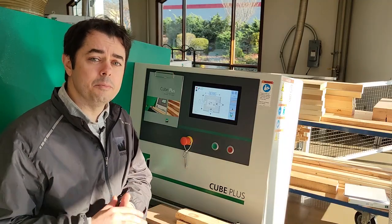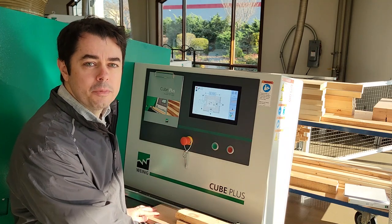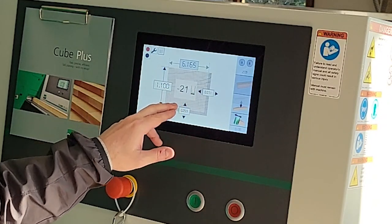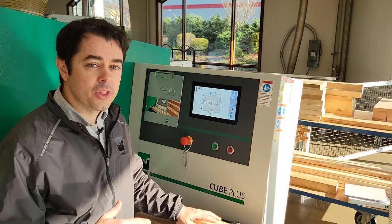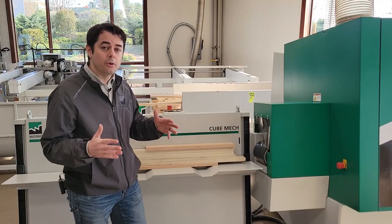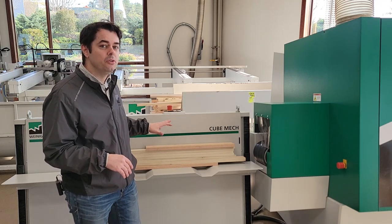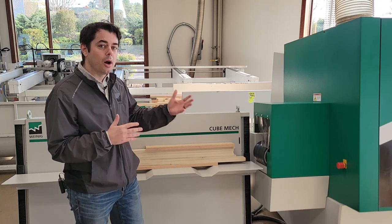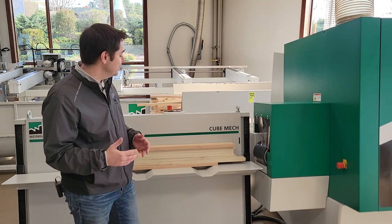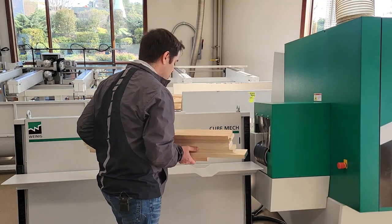Now we're at the controller. As I mentioned, the auto stacker and the machine are cabled together so they can talk. Because when you're feeding the machine from the infeed, you don't have a great view of the outfeed. So the controller tells you right here, with a number displayed in the middle of the workpiece diagram, how many pieces of the current thickness you're running can be put on the auto stacker before you have to unload it. Also, because the module is not bolted to the machine, it can easily be moved out of the way, turned off in the controller, and brought back into operation at any time. The tray comes with two indents, making it easy for operators to pick up their load of workpieces.